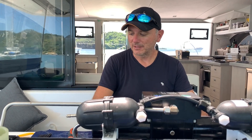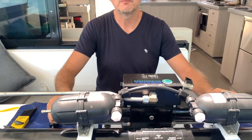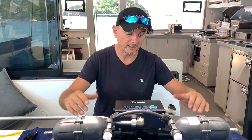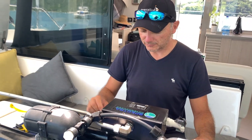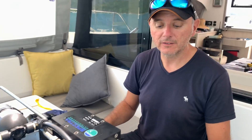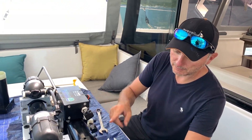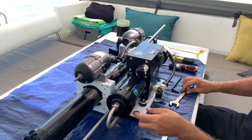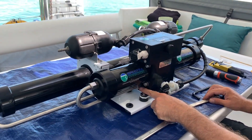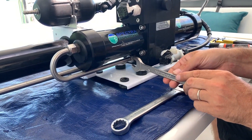In order to replace the cylinder you need to take out the pump — the water maker — from wherever it is, because there is absolutely no space to work in the locker. Spectra didn't make things any easier because, for example, to remove this J2 I need to undo this bolt, and there is no way to work with a wrench here.